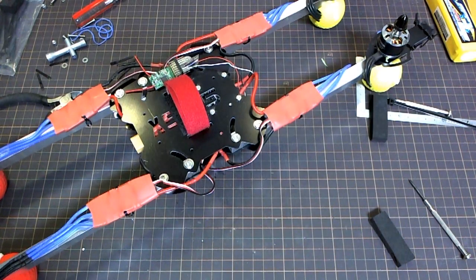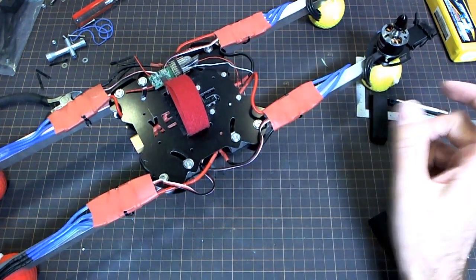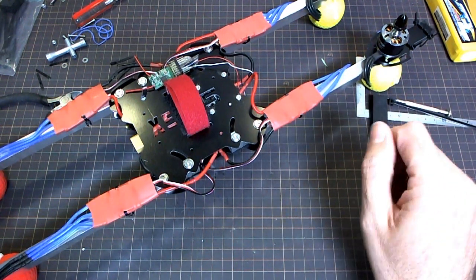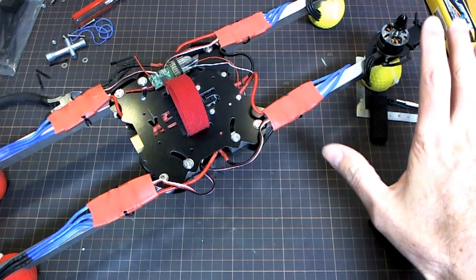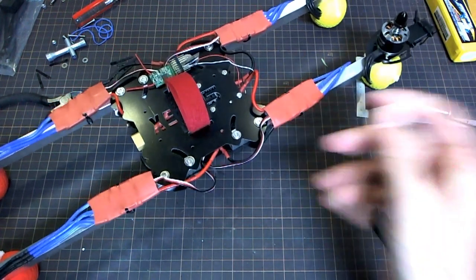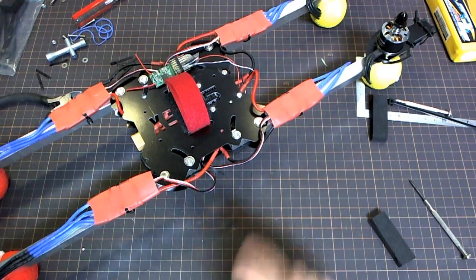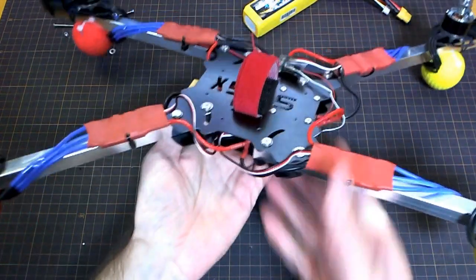As you can see this is by no means a new idea, and if we get something like that happening there will be problems. I noticed that in the YouTube clip he's holding the arm of the quadcopter down, so when that sympathetic vibration appears it just stays because he's also controlling the motor speed exactly to get to that point. My theory is that in actual flight there's a lot more freedom of everything to move, so it'll be harder to set up those sympathetic vibrations and they won't stick around as long when they do show up — at least that's my theory.